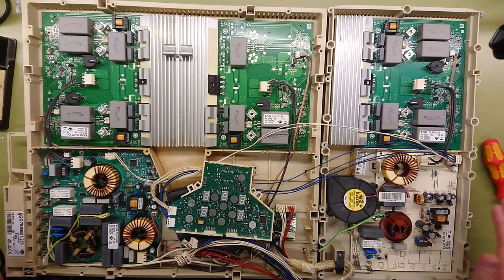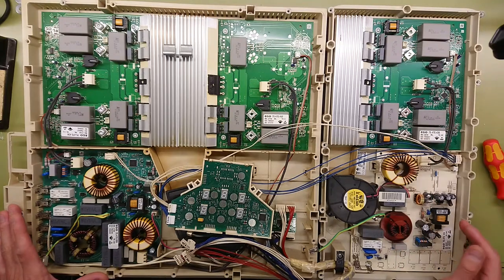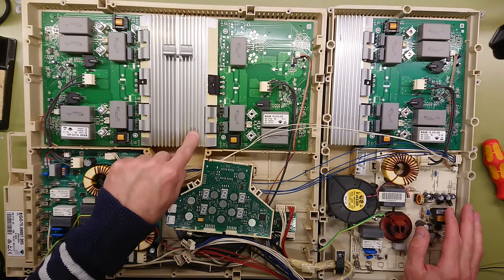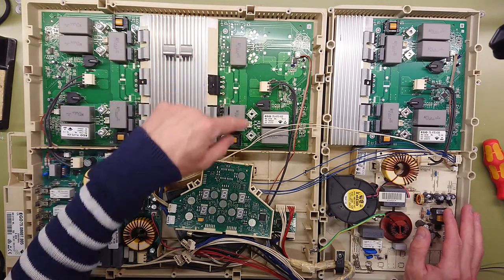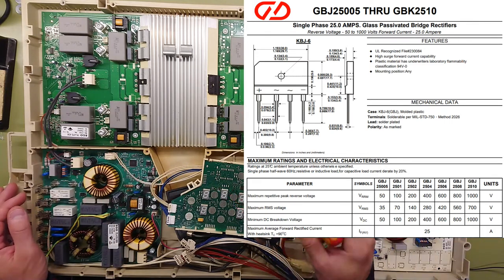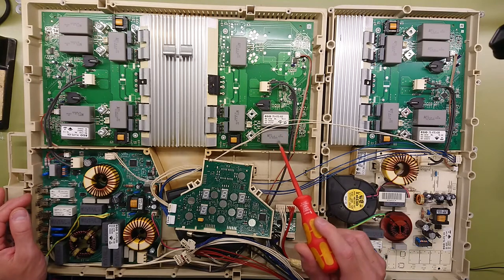The whole design seems modular — this module can be sold as a four-zone induction cooker and you can add another module for an additional zone, or this module could be sold as a two-zone or single-zone board. We can see only one configured induction heater circuit here. The DC bus capacitors are the only components in place on both sides. It starts out with a GBJ2510 bridge rectifier — a 1000 volt, 25 amp unit — and the half-bridge controls the LC circuit for the coil.